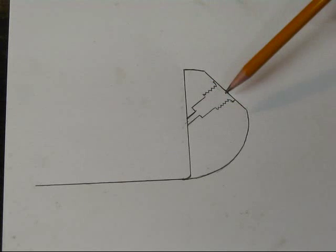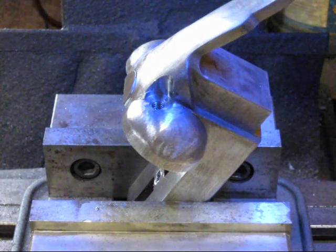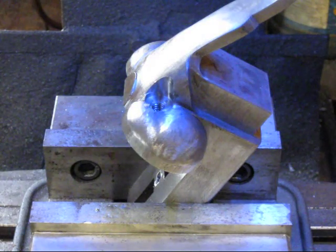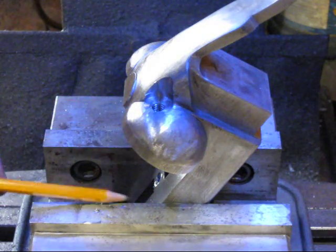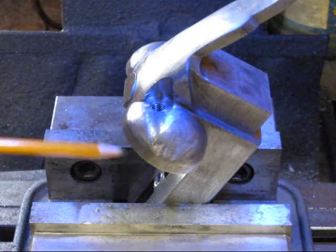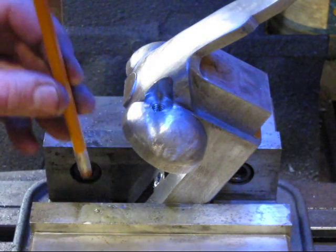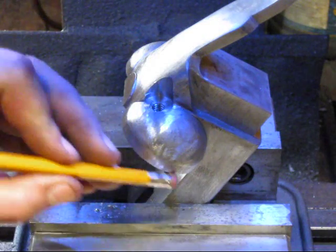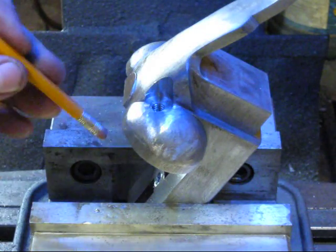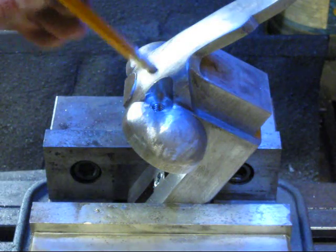You'd think it's just a little drill work and some tapping, but it actually takes quite a bit more work than that. I'm going to show you the setup on the mill and the tooling involved. The double rifle is actually easier to do than the single shot, because on the double rifle the firing pin center line is basically the center line of the outside edge of the action — it's a single angle that penetrates straight through from top to just above center line of the firing pin. Whereas on the single shot it's a compound angle coming in from the outside as well as down into the center line. So the double rifle is a little easier to get the center line drill point.